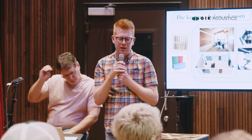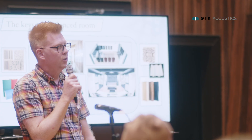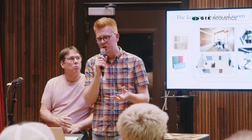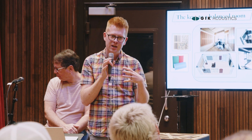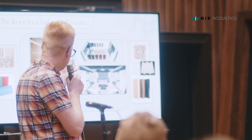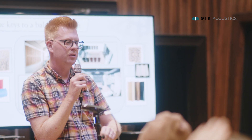It's all about balancing the frequency response in the room and getting the decays under control. Because we're human, we want to feel comfortable working in these rooms for long periods. In a live room it's less critical because you can move a microphone or an instrument closer to a reflective surface or an absorber. But in a control room or mixing room, you have one spot and the speakers don't move — it has to sound right in that location. That's why placing different types of panels in the right locations is so critical. The room isn't doing us any favors.